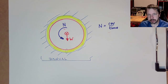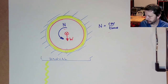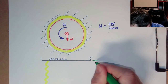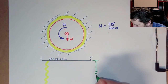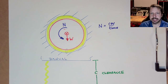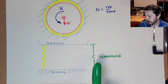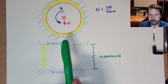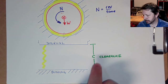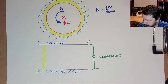In between them is our lubricant. Petroff assumes that the clearance — labeled c — stays the same all the way around the journal. That's not true in practice; the clearance is tighter in one area and larger in another. But everything we'll look at today assumes this clearance stays consistent all the way around, and it will be labeled c.